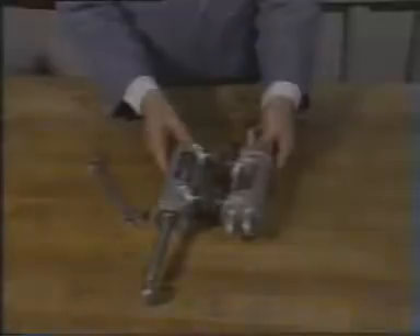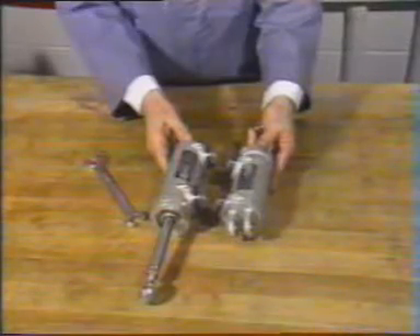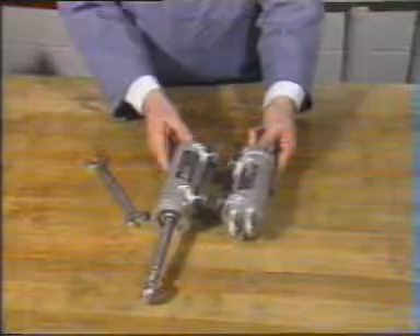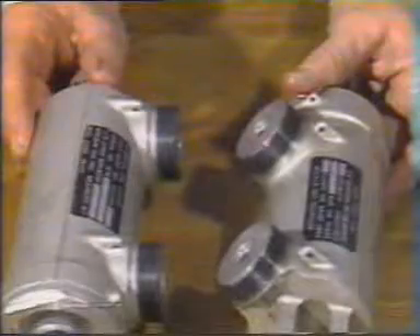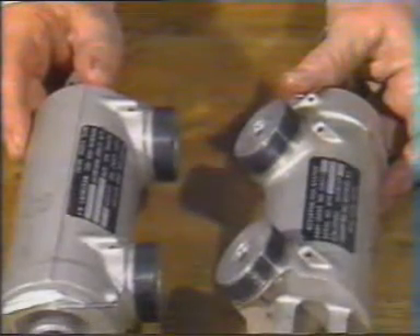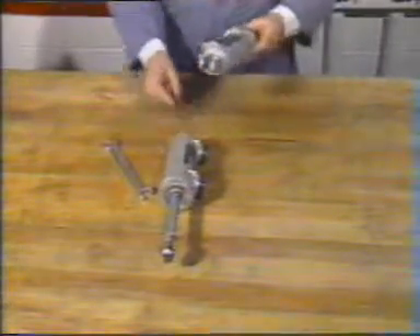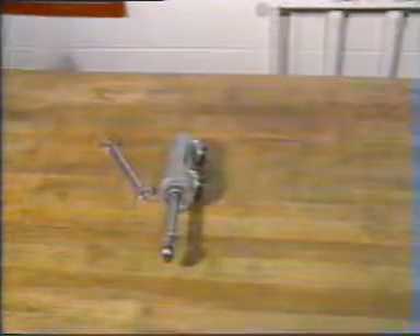If the actuator is to be replaced with a new one, check to be sure that the part numbers of the old and new actuators are the same. This is important because the actuator must be compatible with the speed sensor installed on the gas generator. If the part numbers are not identical, an adjustment of the actuator rod end will be required. Improper actuator rod adjustment will cause off-schedule variable stator vane operation, which could cause a compressor stall. If an adjustment is necessary, refer to the maintenance manual for the proper procedure and specifications.